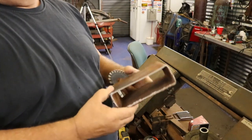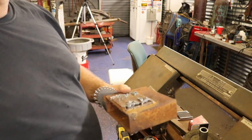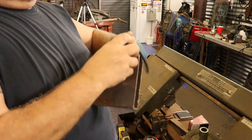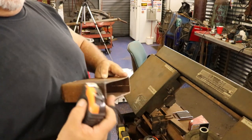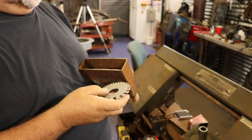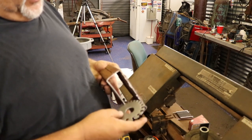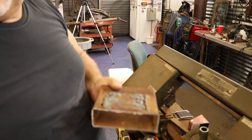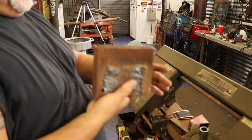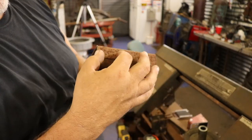First thing I'm going to show you is the material I've used. My main square tubing — that's the big square tubing on there — the piece that goes underneath, the uprisers, and the pieces that shoot out, is six by two inch square tubing. Here's my little gauge to give you the thickness of the steel. This one is 12 gauge steel, which is right at 109 thousandths. That's the base of it — you can tell this piece was bent metal, so this is a seam right through here which I had to weld up. They already had it stitch welded.